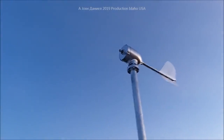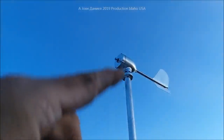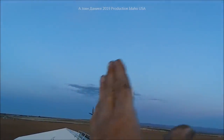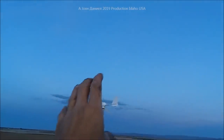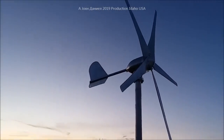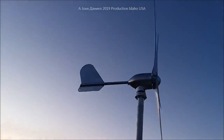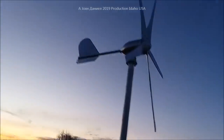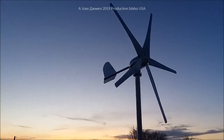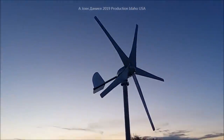We've done our welding. Now we have a little silver turbine about a foot and a half higher than gray matter was, because gray matter affected the power the little billy turbine was doing - when in line with it, it would cause a lot of prop wash that would disturb it. We fixed that by going higher. Hell of a job hauling a welder up here 35 feet off the ground. It's up silver - aluminum gray. It's going to look sharp come tomorrow. Winds are going to be up - y'all look for the next video where we're going to see what this thing will do in 20 to 30 mile an hour winds.